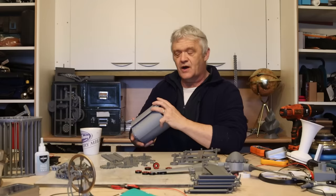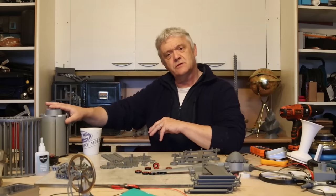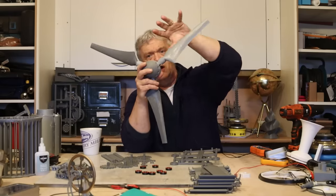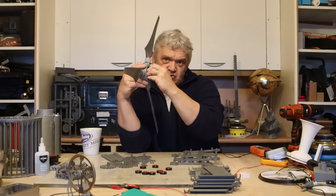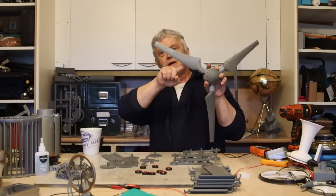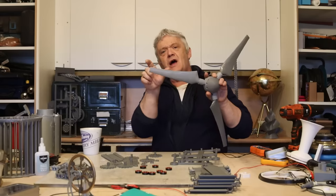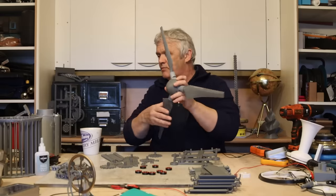This is one of the things I find quite gratifying, because for ages I've been talking about generation at the rim as opposed to generation at the centre. The idea with a standard HAWT is the wind interacts with the blades, the torque is transferred to a central generator — that's the standard way of generating from the centre, requiring a great deal of torque. All of the energy really is on the tip of the blade and very little is here, and this is pretty much wasted space. If you're able to use this section and generate at the rim, then you're going to get better generation. It's something I've been saying for years.